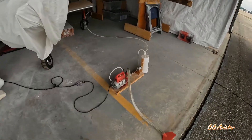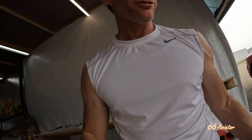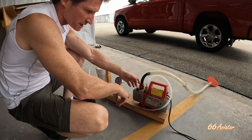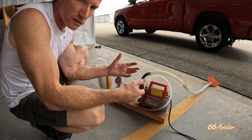Day two working on the flaps. I want to explain a little more about vacuum bagging. This is a vacuum pump, and it does exactly what you'd expect — it's a vacuum. You could literally use a vacuum cleaner to do vacuum bagging, but eventually the motor would overheat and it's a lot louder. It does work because I've used it before. Here's a better view: it's just an electric motor with a pumping mechanism on the end, with oil to keep it from getting too hot.